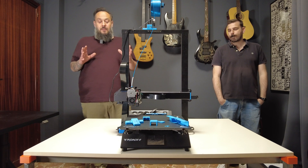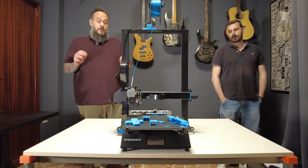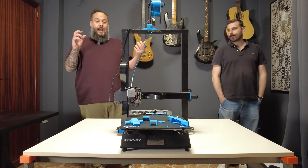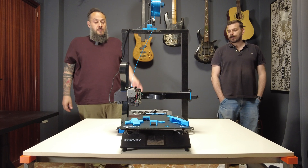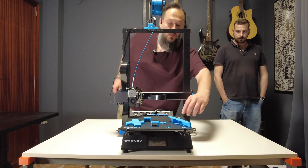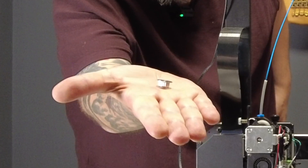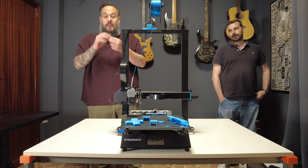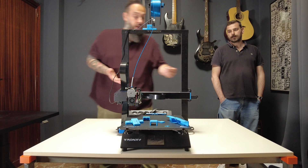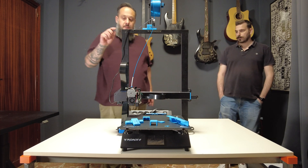Then I went to something more for me. I like the belt to be driven by timing pulleys — not classical pulleys like the defaults, but pulleys with a gear, to have traction on both sides of the belt. So I replaced the standard pulley with a timing pulley, and it grips on both sides.